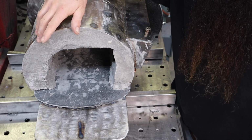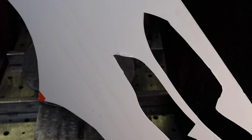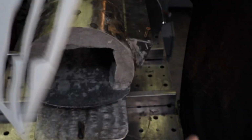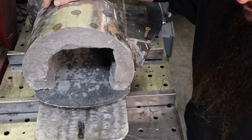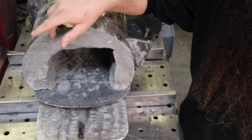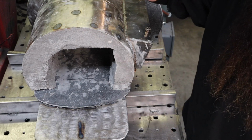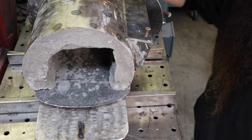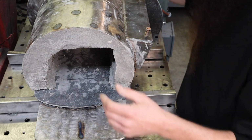I'll cut this foam board stuff up, and I even made some knife templates out of it too, just for quick, you know. It gives you a better feel. Like I said, I've built the strut towers on the Jeep. I built a model out of that stuff, and then tweaked it from there. It's super easy to use, and then you get it dialed in. Then you have a pattern for your steel to cut that out. Anyway, that's a rambling bunch of stuff that you probably don't need to listen to.